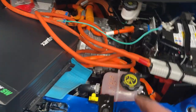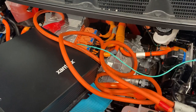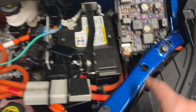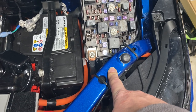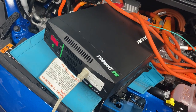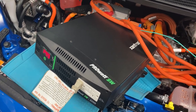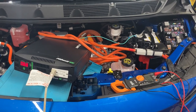The main thing is I'm going to shorten these cables — they're a little long, just because that's how long they were when I got them and I repurposed them. No reason to make them shorter when you can never make them longer again. And I think a 150-amp circuit breaker is going to be the right thing here — that should be good for 1,800 watts, which is really the maximum continuous power of this inverter. That's it for now; this is kind of my experiments figuring out what makes the most sense.